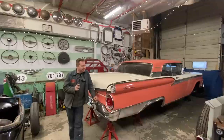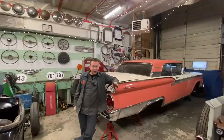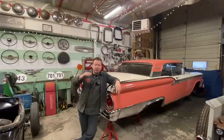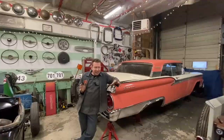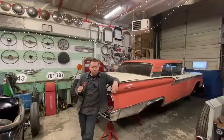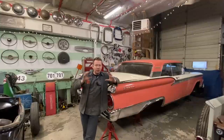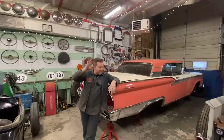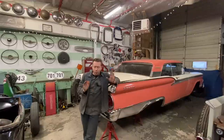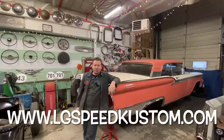So for the shocks, we're not going to do that right now because it is five o'clock, it's the end of the week, I'm hungry, and I don't even have shocks to try in there - parts store is closed. So we'll do that on another video. But in this video we covered raising the driveshaft tunnel and building our rear airbag mounts. Next video we'll do shocks and then maybe start laying out some of the air tanks, the compressors, and looking at the air management system. This car is going to be having an AccuAir E-Level kit which has little sensors that we've got to figure out on the suspension still, so that the computer knows where the wheels are sitting all the time. So it's way less complicated than it sounds.